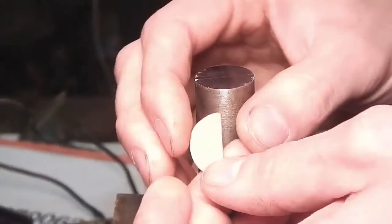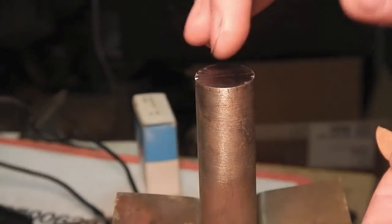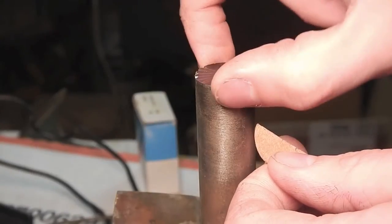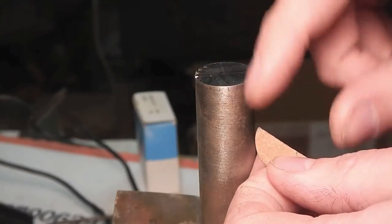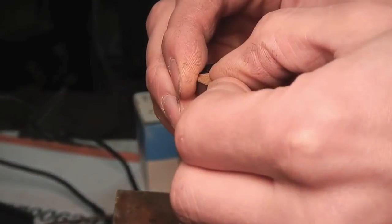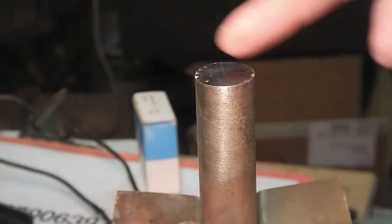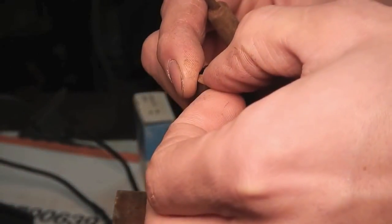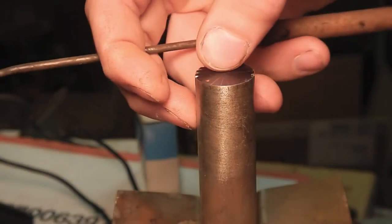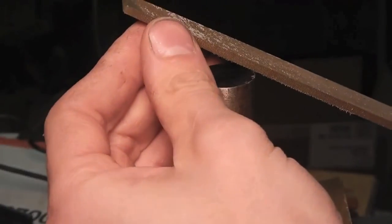I cut this little paper piece out here. It's half a circle with the same diameter as this piece here. You can just draw a line, set the compass to the radius — that would be half the diameter — then trace it out and cut it out. You can use that on here to connect the teeth together to make sure that each tooth, as you're filing it, goes right to the center. You just put it on there and scribe a line. You can see that it shows up well against the black marker.